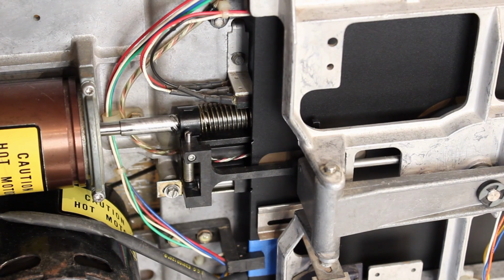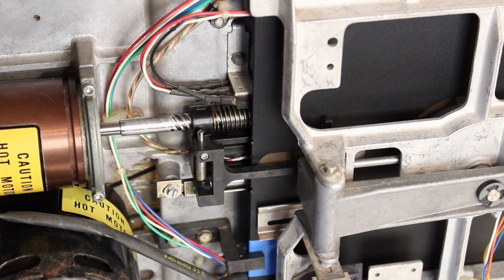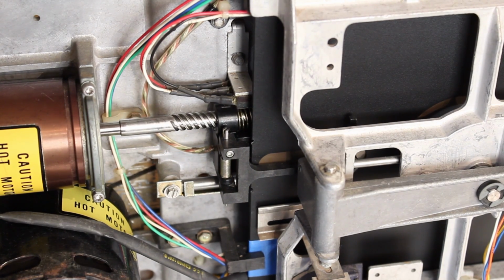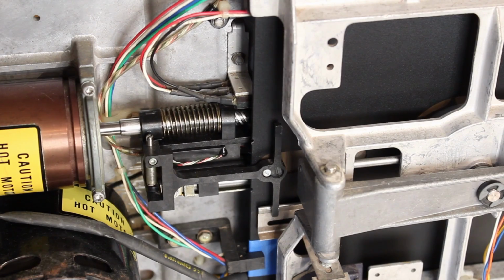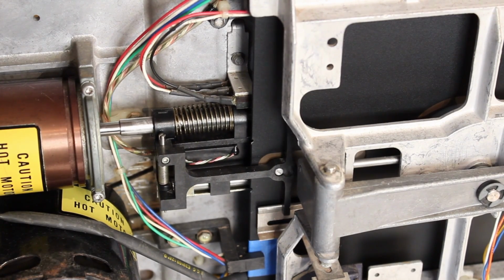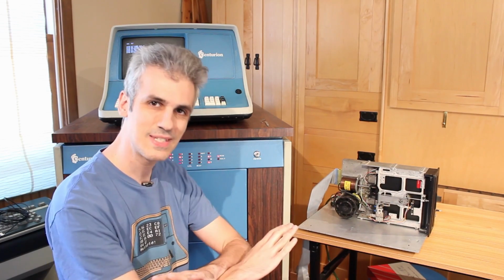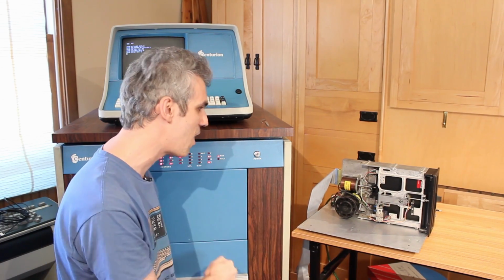So it didn't just run into the stop at the end and just sit there hammering on it like it did last time. So most likely I just had a bad ribbon cable connection. There was a bunch of stuff going on trying to get all that stuff filmed. I must have just missed it. But it looks like the seek test is working perfectly on the Hawk drive.